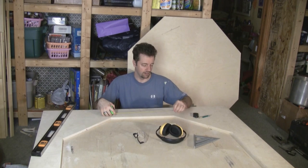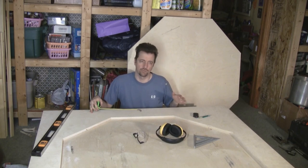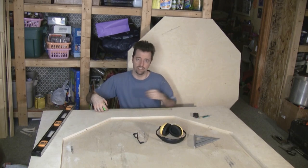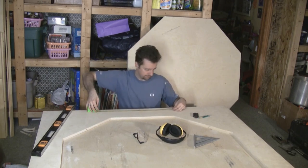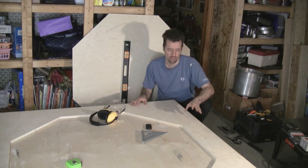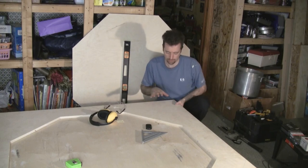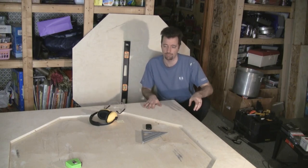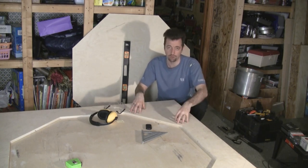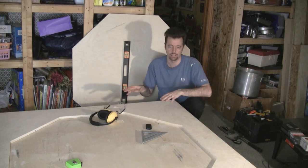Using the handy octagon calculator I know that for a 60 inch wide piece of plywood my sides should be 24 and 7/8 inches, roughly 24.85 inches. So from the center mark I'm going to measure 12 and 7/16 inches in each direction and that will be the length of my side. When the lines are marked, square up your two sheets of 5x5 plywood as perfectly as you can. We're going to cut them together when we cut the corners off so you have a nice smooth angle on each corner. I'm going to tack the sheets together with a few brads from my brad gun just to stop it from shifting while I'm cutting — only through the waste sections, not through the ring or the table itself.